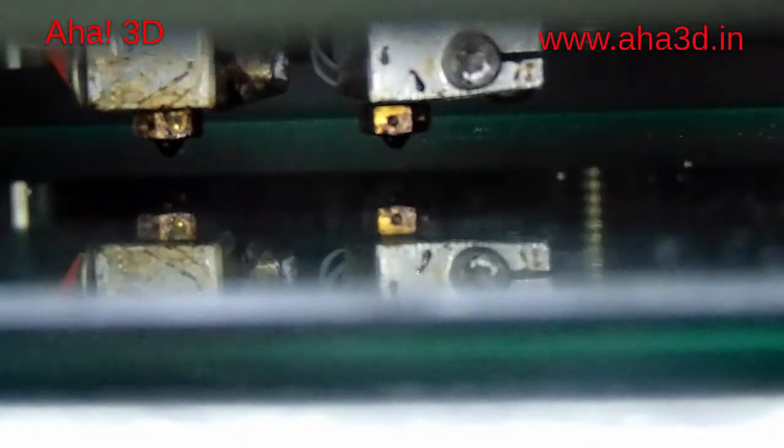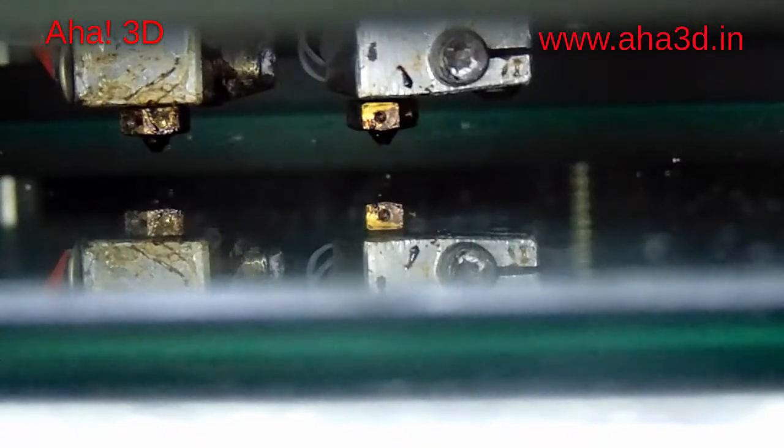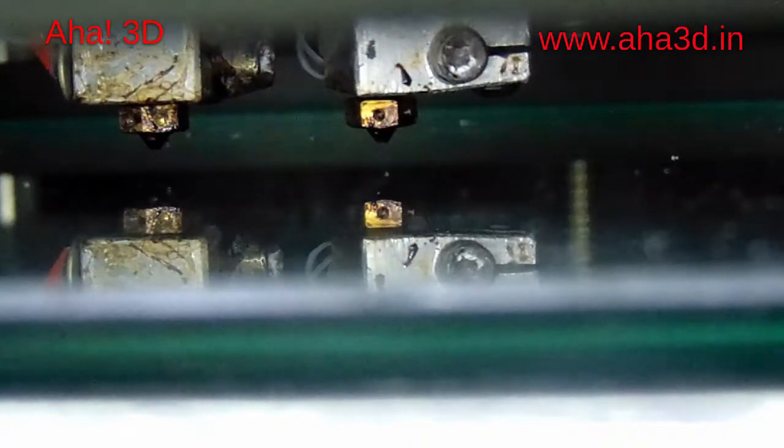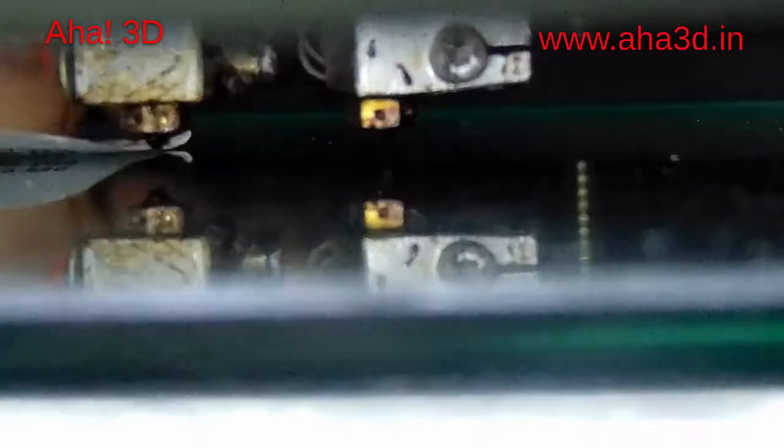When we move this pin between the extruders and the glass, this pin is moving freely. That means there is a huge gap between the glass and the extruders. This gap should be minimized — just enough that a piece of paper can move freely between the glass and the extruder. As we can see, this is a paper sheet. The distance between the extruder and the bed should be reduced so that only this paper sheet would be able to move between them.